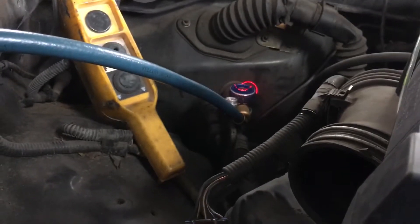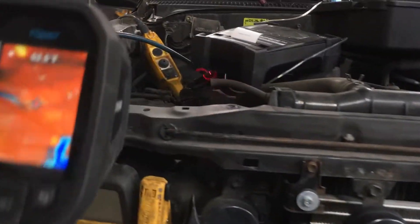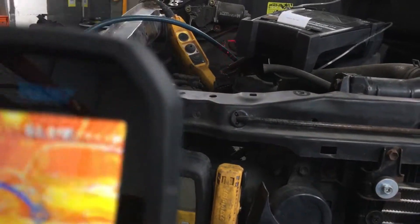This is actually pulling refrigerant up through the gas, along the liquid line, and then going to the firewall, through the expansion valve, through the evaporator, and then out of the evaporator to the suction line — out of the low side service fitting right there. By doing that, I'm not pulling out oil from the system, because I'm so far away and it has to drop into a larger pipe, lowering its velocity, leaving the oil behind in the evaporator. The vapor refrigerant boils off the top before it comes out.